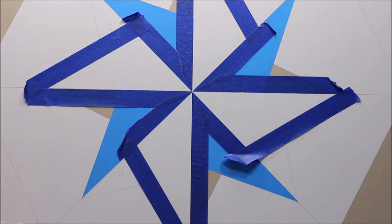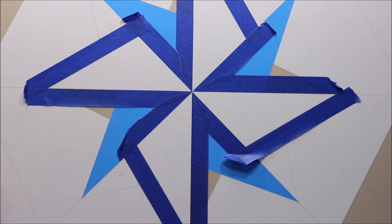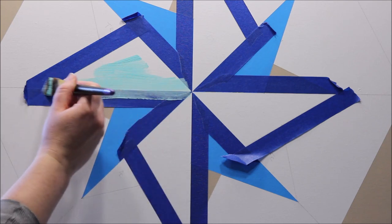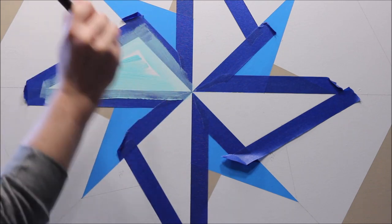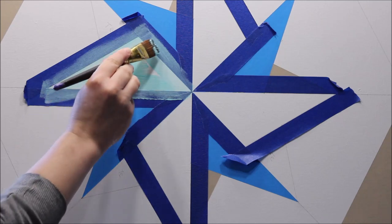It's going to take 2-3, perhaps more coats of paint. We want to make sure that this is thin so it dries evenly and it doesn't peel when we pull this tape off. This is an important step. And so I'm going to start right in the middle there, and I'm going to paint just horizontal or parallel to this tape. I don't want to paint like this, and that's going to push paint underneath of that tape.